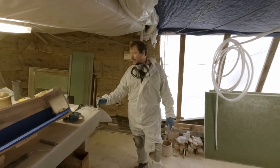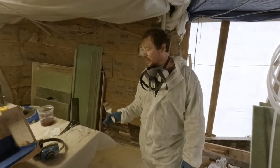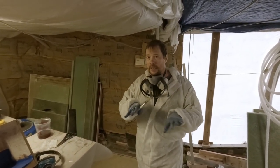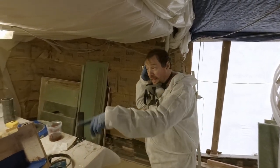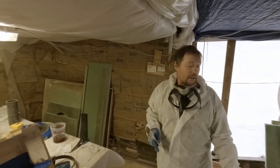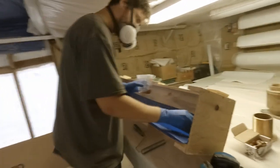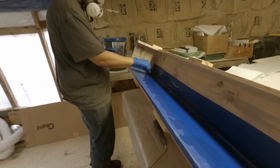Some people mentioned just laying up on plastic. If you're not worried about the finish of the part, you certainly can. What tends to happen, though, is the stuff will get hot and stretch or melt. Doesn't melt through, but it'll definitely stretch, so you'll end up with ripples, like really bad. So Matt actually made one part just on the plastic, and it looked terrible. It was for the piece that I'm gonna glue in down there, and it just wasn't usable. But yeah, it's hard to believe we got this much mileage out of this form. Yeah, crazy actually.